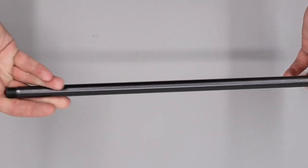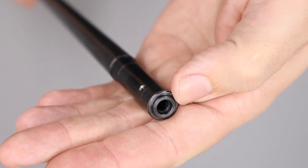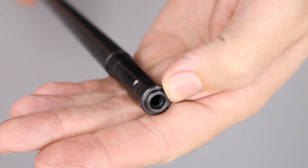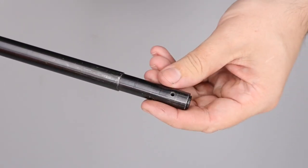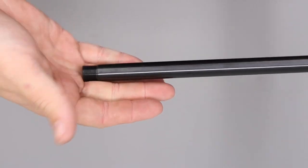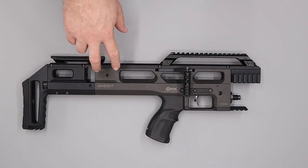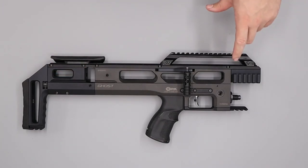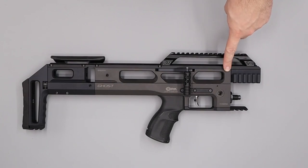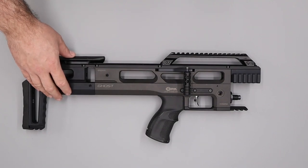There we have the barrel fully disassembled. We still have the transfer port o-ring in the end of the barrel — if this was leaking you would feel a small puff of air every time you took a shot. This o-ring should seal around the pellet probe and stop air escaping when the rifle is fired. We also have two o-rings in the block that seal around the OD of the barrel and a third o-ring in the front section of the block which centralizes the barrel.